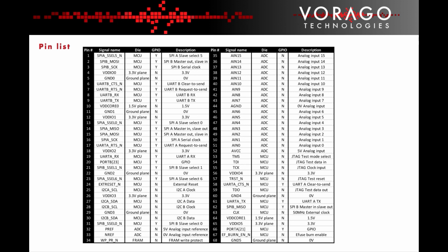There is a JTAG port for programming and debug, and 24 configurable 32-bit timers available to the user. Many of the digital pins have dual-purpose functionality, meaning that up to 21 pins can be used for GPIO functions.